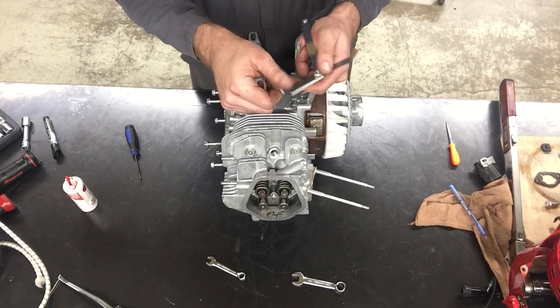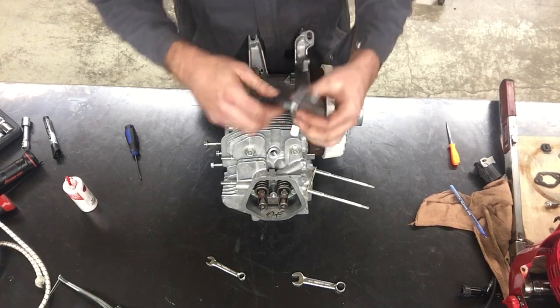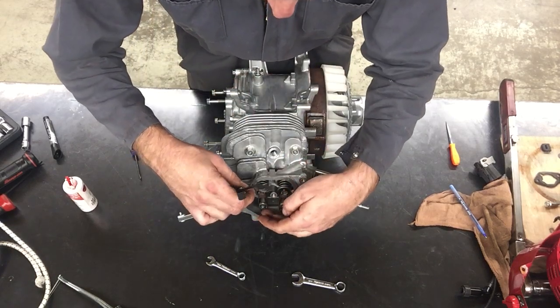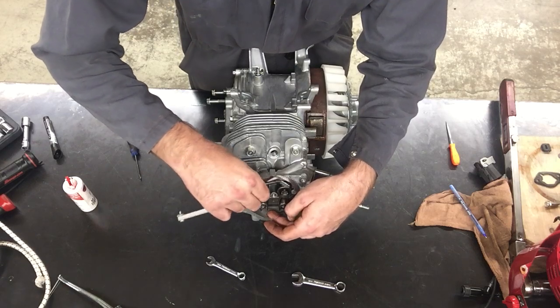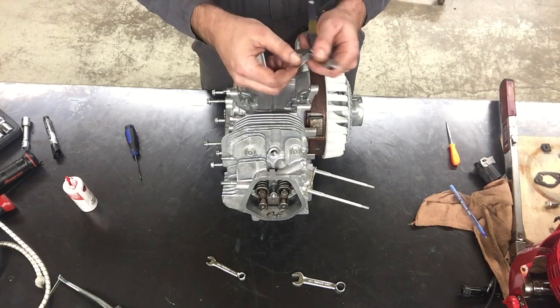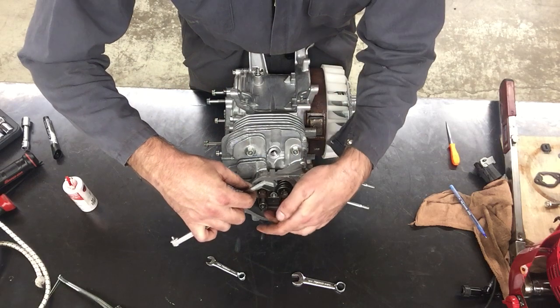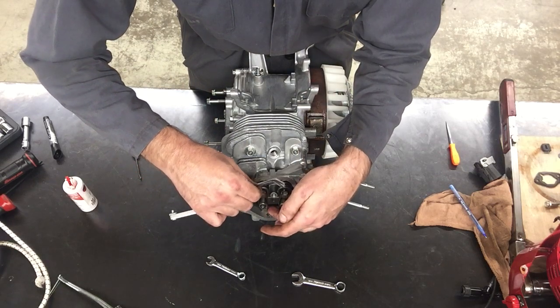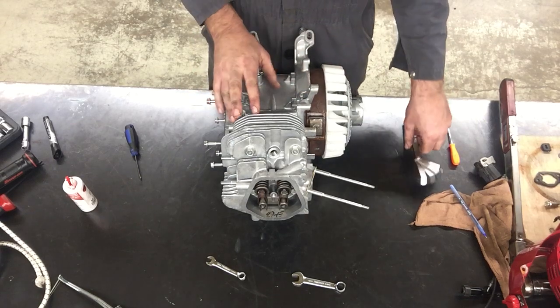The eight slides in — a little snug. I'm pretty sure the nine is not going to slide in, but nine is okay because it's allowed to be plus or minus one thousandth of an inch. And the nine just slides in. Now I'm going to try the ten — if the ten goes in I'll be outside my spec and I'll need to tighten it. The ten doesn't go in. Just got lucky, I guess.